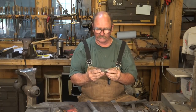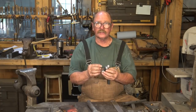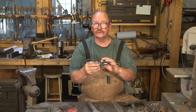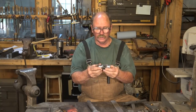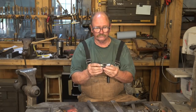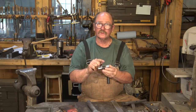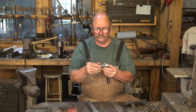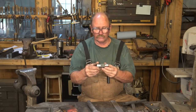There's really nothing else that has to be done with this hammer before hardening and tempering, but I think I would like to put a little bit of decorative file work in right at the edge of the eye. I'll leave this area as-forged so that it is obviously forged, since there's so much grinding on the rest of it — although you could easily polish this entire thing and make it all bright and shiny if you wanted to. But just to add that little touch of something extra, I'm going to do just a few little scallops with a half round or a round file.